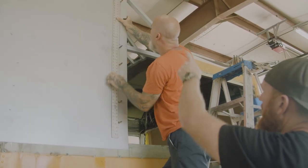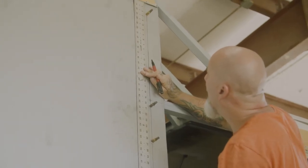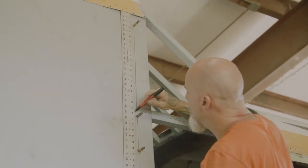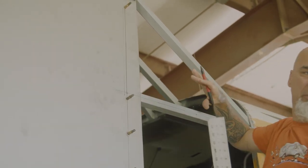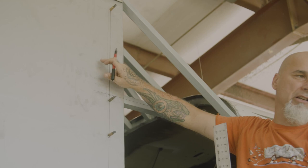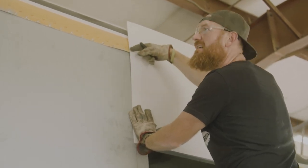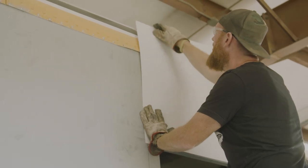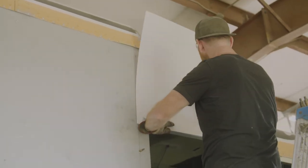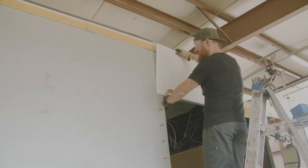I'll just use that Cleco that's already there. Yeah, this will be in your top hole. Yeah. And then your ED, you know, use the corner piece. Yeah, use your pattern, or your paper, to actually square that out. You don't have to put it all. Make my line here and get a cut. Yeah, you can for sure, yep. And then I can cut that section out. Yeah. Get the rivets in first. That way you've got your points set exactly where you need them.